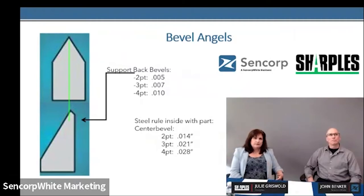With center bevel, you typically have 53-degree or 42-degree, where 42-degree is going to be sharper. We have an edge-hardened 42-degree that you can utilize in your trim press. There's also a 30-degree, which is really razor-sharp. But keep in mind—one shot and it's gone. You're going to lose your edge. You need to be mindful of your operations, and if you have proper setup controlling that shut height, that helps preserve it.